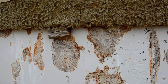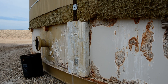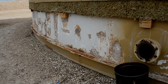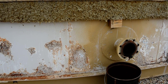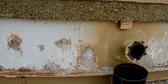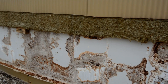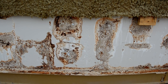As I go around this tank, the shell is in similar condition all the way around. You see that there's at least two different coatings on the tank — I don't know if that's a base color, or one was a finished coat on top of the base, or if it's two separate events. But the pitting is definitely from two different events. That CUI has been pretty extensive.